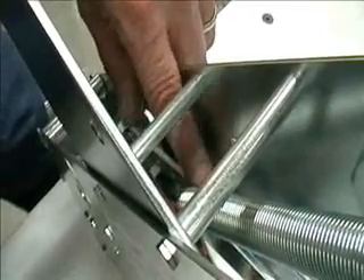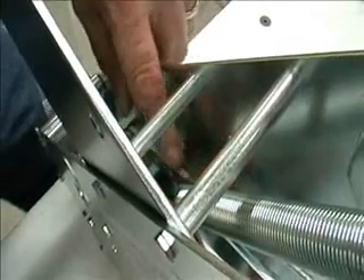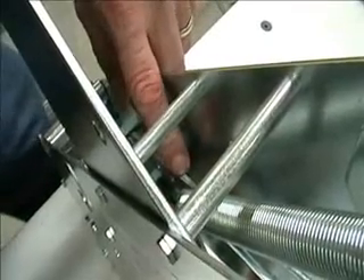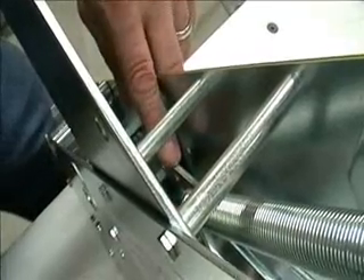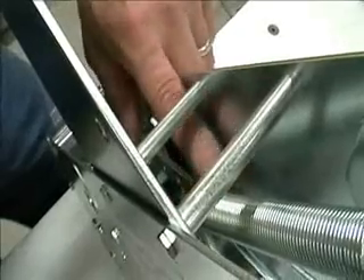If you have a light box, you're going to want to move that spring back this way. If you have a heavier box, you want to move it this way. A lot of that is going to depend on how the unit is wiping the tape down too. If you get it too tight, sometimes it has a hard time forcing the tape head open in order to make it work. So then you have to back the spring pressure off again, which means moving it this way.